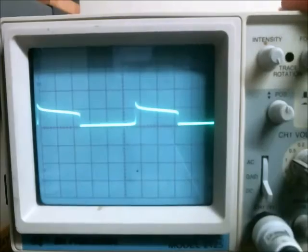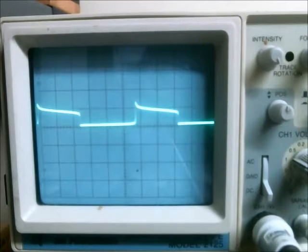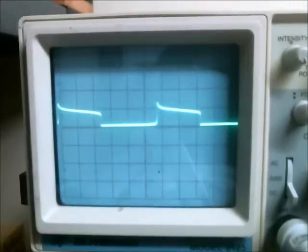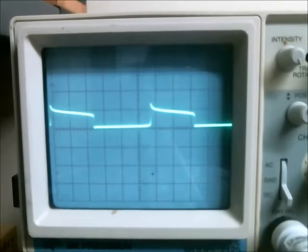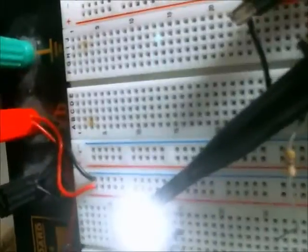So recently I've been analyzing a Jewel Thief circuit, and this is the pulsating waveform from that circuit. I'm using a white LED, and this is the signal I'm seeing on my oscilloscope — I'm at one volt per vertical division. That should be at least three divisions in order to turn on the LED, and the LED is on, with the oscilloscope attached to it.